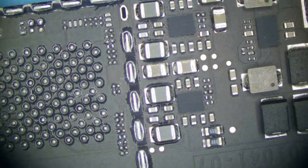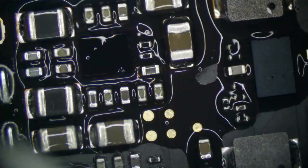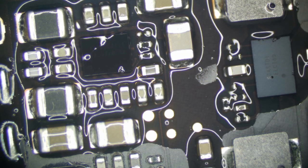We're going to look visually — do we see anything of concern? Yes, I do not like the looks of this capacitor. It looks a little bit discolored and looks like it has a crack in it — that might be the issue. So I'm going to get a little alcohol on a Q-tip, rub it on there, and see if it fizzles on that cap to narrow down the problem. And what do you know — that's going to be our problem right there.